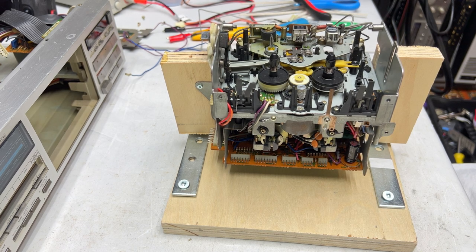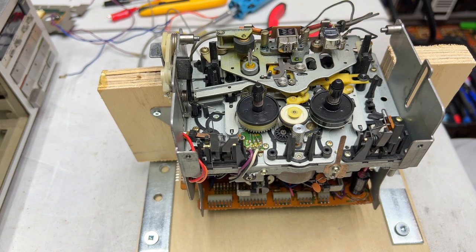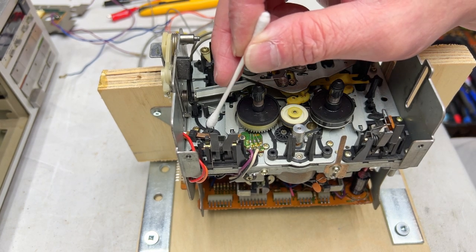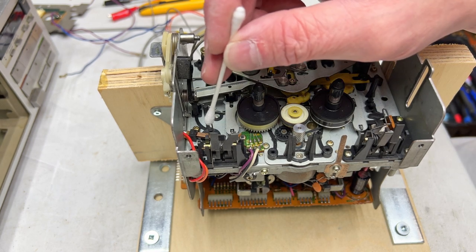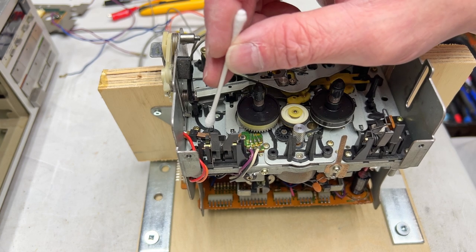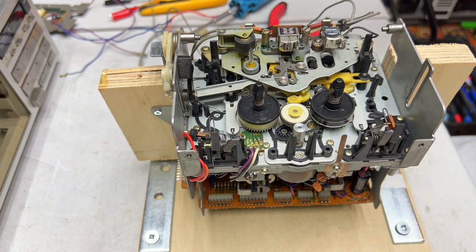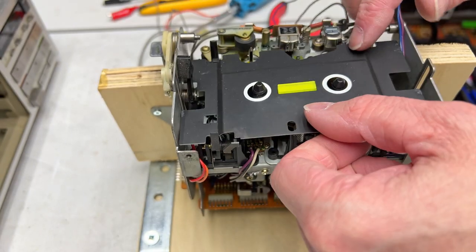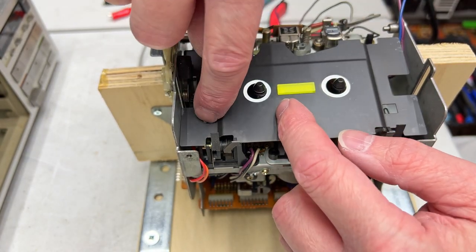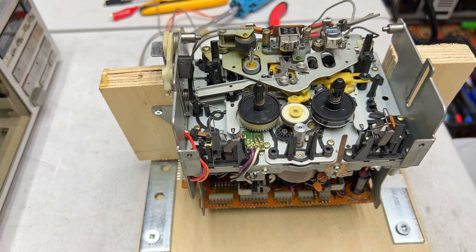Now I'm struggling to think, do I need to tell you about any more things? Well, actually, there is something I could talk to you about real quick. And that's these little springs here. You're going to wonder if they're maybe flopping around loose when they shouldn't be. But in fact, these springs engage with the door. So just leave them be, just like this. They're on both sides. And what happens is the beauty plate goes over top of those. I can show you real quick here. And then the door presses on those springs through these holes here on either side. So yeah, that's how that works. So don't worry about those springs.